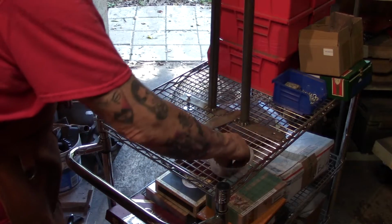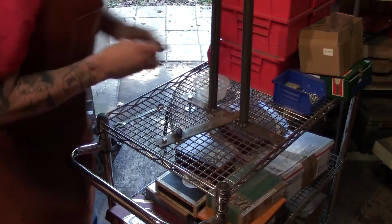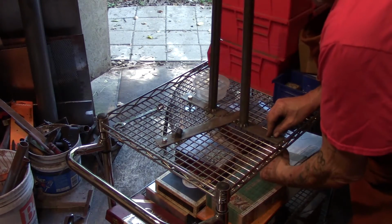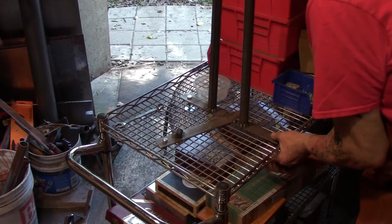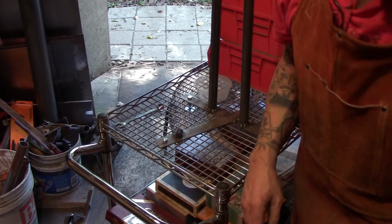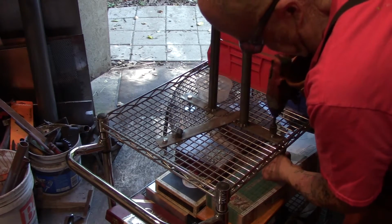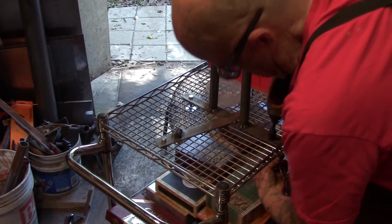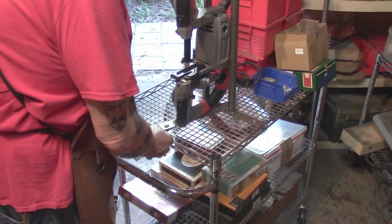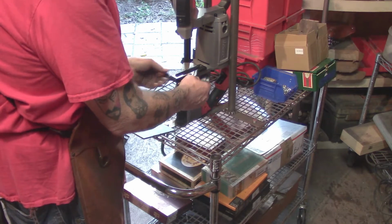And so the back piece is 14 inches long, 2 holes drilled into it for mounting, and the bottom piece here, as I call it, that comes down angled off a little bit to the side to capture the bottom of the saw, is an 11-inch piece. And there is the one that I welded on, the stopper, as I'll call it. That helps orient the saw. The 2 upright pieces keep the saw oriented right to left to keep the bed level right to left, and the stopper orients it to keep the bed level front to back, or the table as it's called.